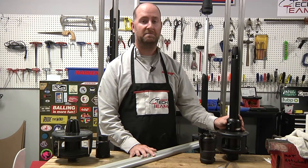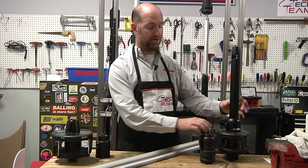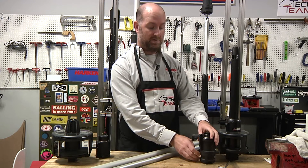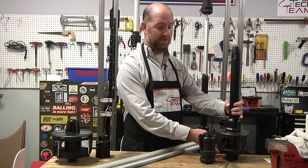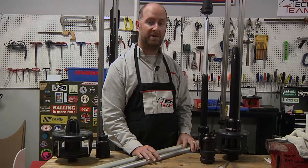The Mark IV offers many features including a double groove foil system, an aerodynamic shape, and lighter weight. It also offers independent swivels both at the tack and head of the sail for better sail shape while furled. It also features easy removal of the drum as well as the guards, which allows you to increase the luff length of the sail while racing.